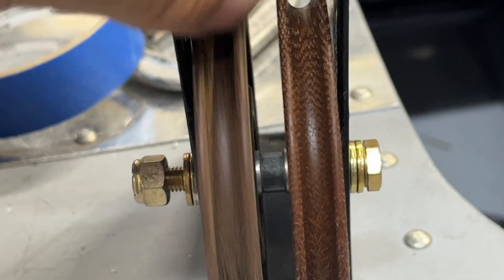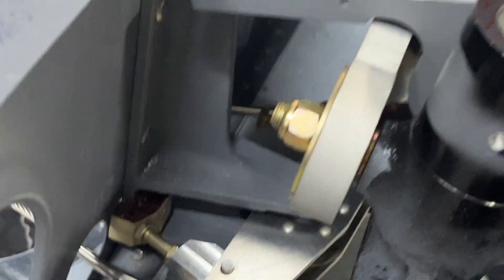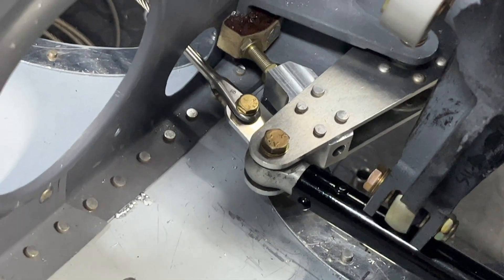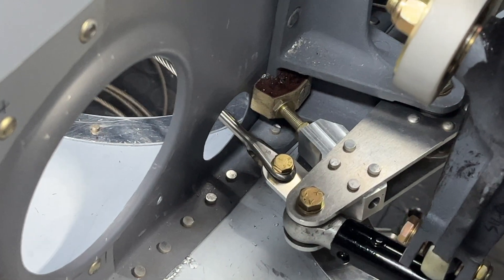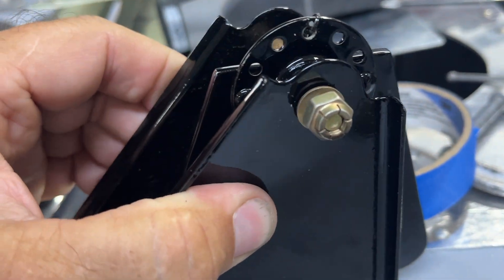A good example is on this pulley assembly. Pulleys have bearings in them, so they spin very freely, and we can just tighten up this fiber lock nut and we'll be fine with that. They're also used on rod end bearings. You can see on the bottom side there's a fiber lock nut — there's a bearing inside that rod end bearing which is captured between the arms of that bell crank. Once it's captured tight, the rod end spins on the bearing and the bolt never turns.